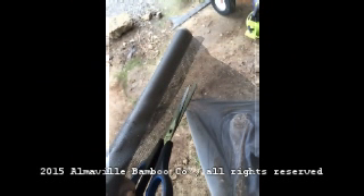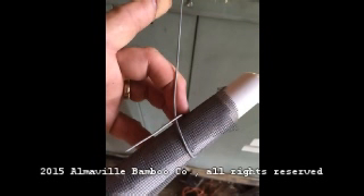The next thing you're going to want to do is cover up all those holes that we drilled in the pipe. That can be done with landscape fabric, or in this case I just used some extra fiberglass screening. You'll need to cut it — sneak out with your wife's best pair of scissors — and wrap it around the pieces of pipe. After you've wrapped the fiberglass or mesh around the pipe, you're going to want to secure it; in this case I just used some thin wire.